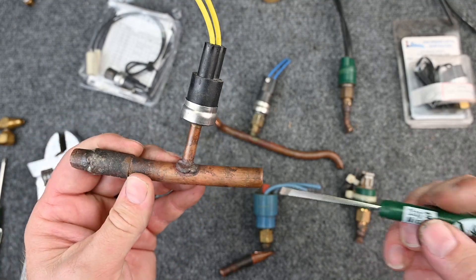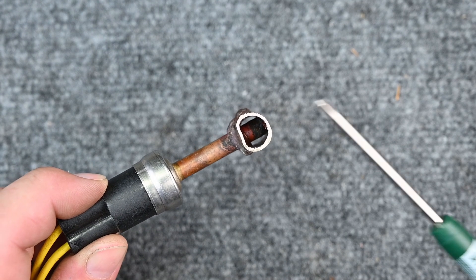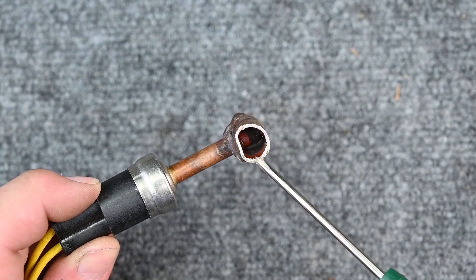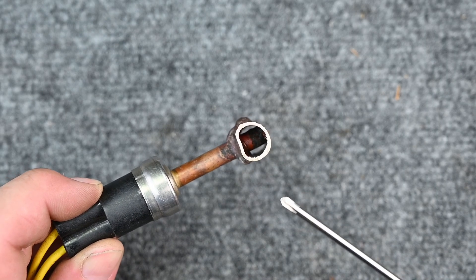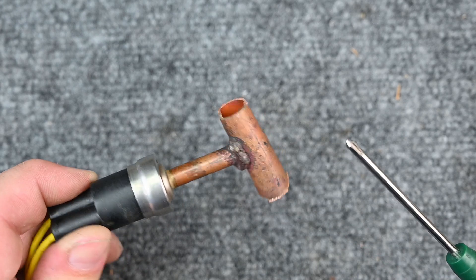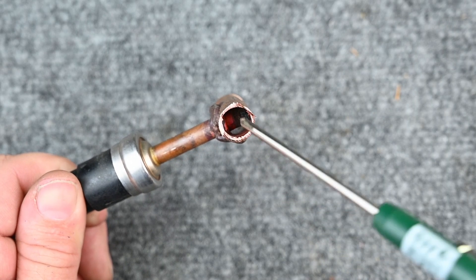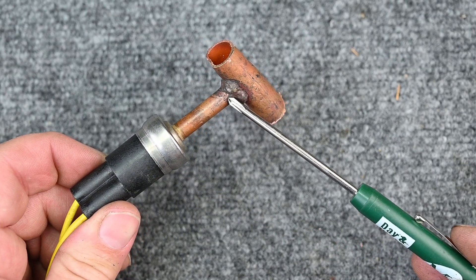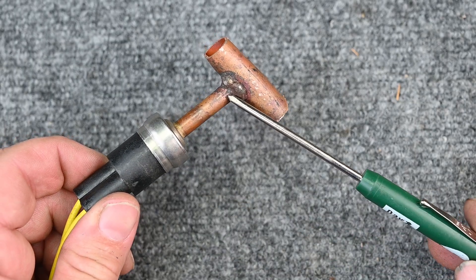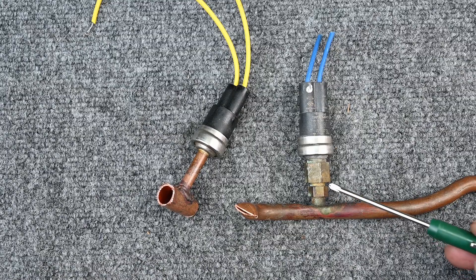The pipe was put all the way through, completely blocking the flow of refrigerant — the very thing they were trying to protect, they made worse. This causes a refrigerant restriction. So if you do have to braze one in, make sure you're not blocking the entire flow of refrigerant. Also, protect the switch with wet rags or heat-absorbing paste while brazing, because that heat will travel up and damage the internal parts. I'm not a fan of brazed-on pressure switches; I prefer threaded fittings, and better yet, ones with a Schrader port inside.